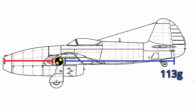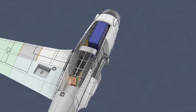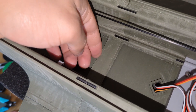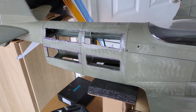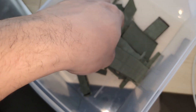For 113 grams in the tail I needed a 300-gram nose cone to get the CG in the right place. I considered using a larger battery instead, but that would require redesigning the interior of the forward fuselage. I also tried cutting filament out of the rear and mid fuselage, managing to cut 31 grams without severely impacting structural integrity, which did reduce the necessary nose weight somewhat.